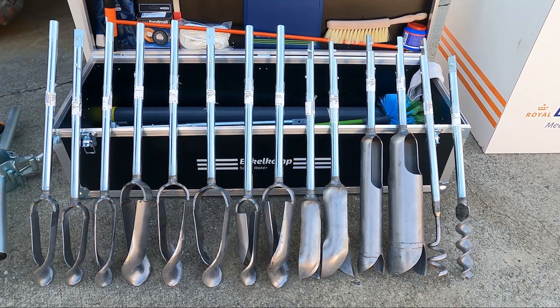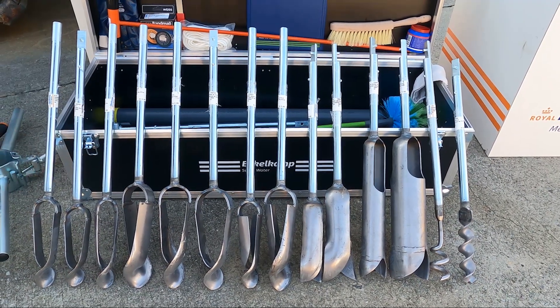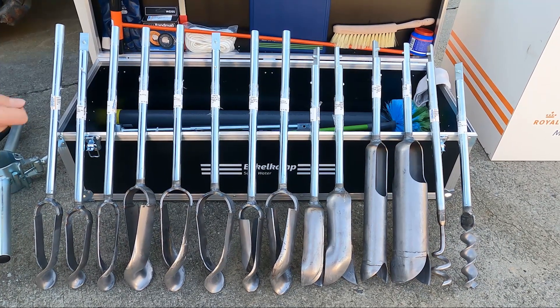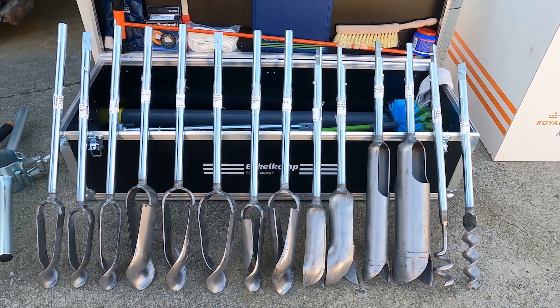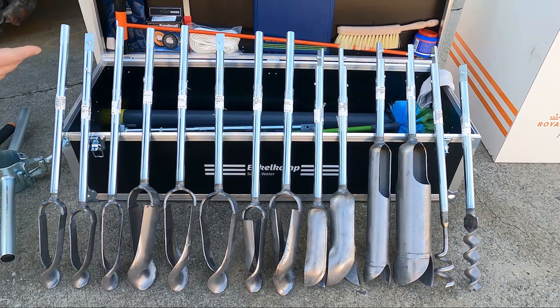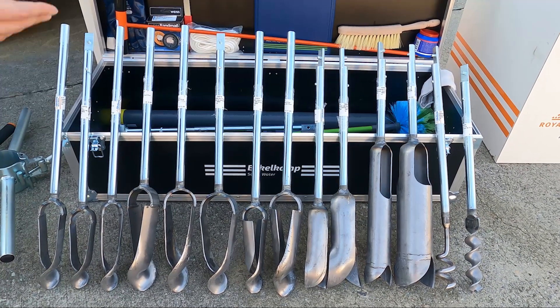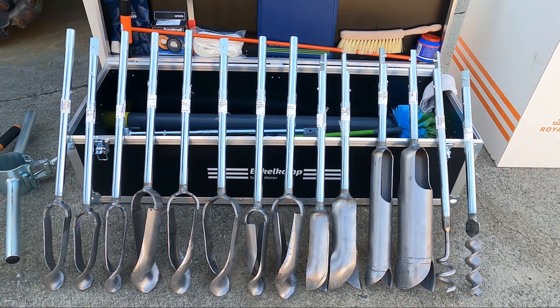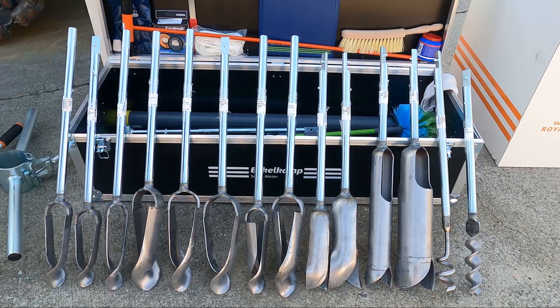We have both seven centimeter and ten centimeter augers. The seven centimeter is for augering inside of your casing, and the ten centimeter is for augering to place that casing. A lot of the time you'll pre-drill your hole with the seven to make sure you can get down, then widen it with your ten. Once you start getting to your groundwater table or where your borehole is collapsing, that's where you'll add your casing and advance it further.